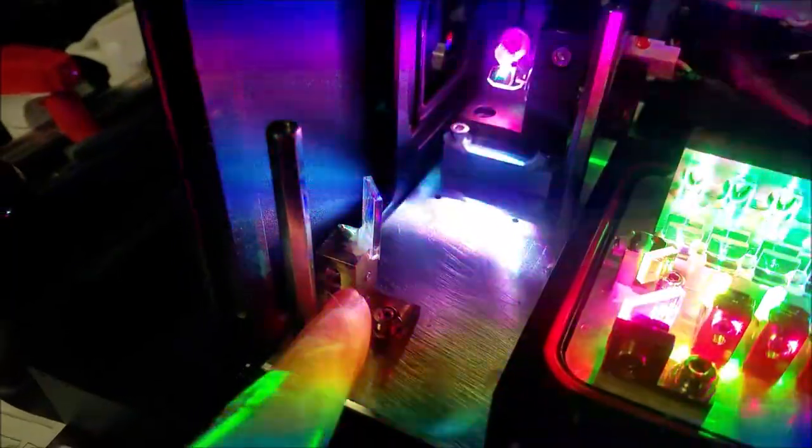All right, the far field alignment is for the most part finished. Of course, we're gonna have to let this sit for a little while and see how the optics walk, but that will be just a repeat of what I did, making sure that everything looks good in the distance. One more adjustment needs to be done, and that is to take this optic and make it so the beam is down a little bit more. As you can see, it's going over the top of the X galvo just a little bit, so that needs to be nudged. Otherwise, it looks decent. Let's go ahead and see what it looks like out in the far field.